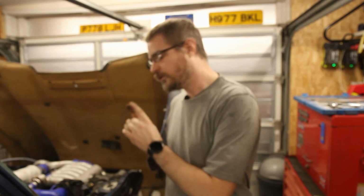So what I can do now is carry on with some cardboard templating for the plates that are going to go onto the engine, try to figure out roughly where they're going to go, and figure out where those U brackets are going to go on the body. If I can, hopefully onto the original suspension crossmember. That's where the Escort that this crossmember came from originally would have bolted up to, so it's nice and stiff, marries it all up with the suspension. But there might be some things in the way, like starter motor, oil filter, various things like that. So I might have to come forward towards the front of the car a bit more and stick those directly on the chassis. So let me get under there with some cardboard and see what we can figure out.